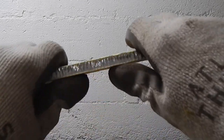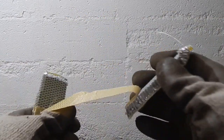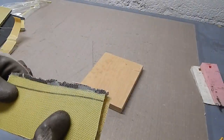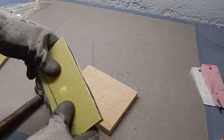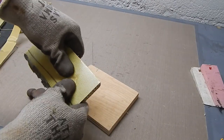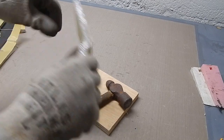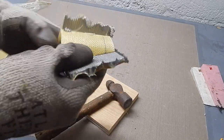Taking a piece here and giving it a break. You can see that bottom skin compresses. Kevlar is not that awesome in compression compared to carbon or glass, and it also really doesn't stick that great. Oftentimes it's used with glass in order to get better adhesion or to get a surface that you can actually sand. Because it's Kevlar, I want to give it some damage to see how well it holds together. It doesn't shatter — I think carbon in this situation would be much more brash, even glass. It absorbs the energy of the hammer. It breaks where it needs to break; it doesn't propagate damage. It's really useful for situations like the bottoms of race cars, airplane wing leading edges, and the bottoms of boats where holes are really bad and damage propagation is a real issue.